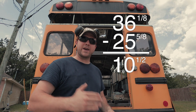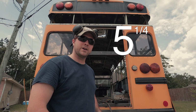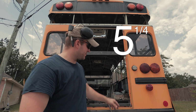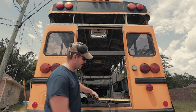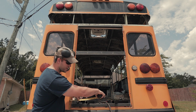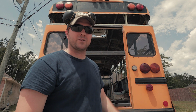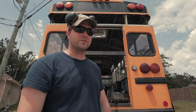And then you would half that measurement. So we go down to 10 and a half, half of that would be 5 1/4. And that's what you get on each side. So we're gonna measure over 5 1/4 here, mark a line. 5 1/4 here, mark a line. We're gonna double check our measurement, and that should be pretty centered enough.